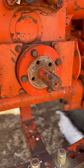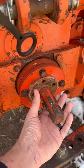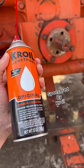The PTO setup on this Allis Chalmers tractor is pretty slick. Right now it's mounted with the outer bolt pattern on the flange and set up for 540 RPM implements. If we need to run a 1000 RPM implement, we have to switch over the stub shaft.